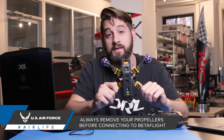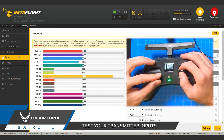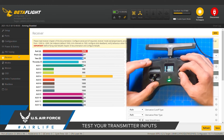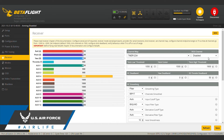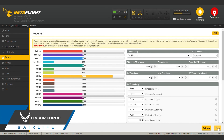Not doing so can be extremely dangerous. When your receiver and flight controller are connected, you can test all four inputs: Throttle, Yaw, Pitch, and Roll. Make sure each stick input corresponds with the correct maneuver. If the inputs aren't reflected properly, you can use the options in the channel map tab to correct it. Always make sure you save your settings before changing tabs or disconnecting your drone.